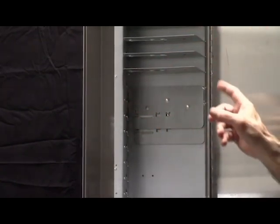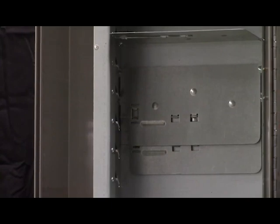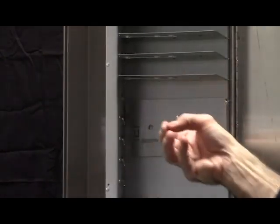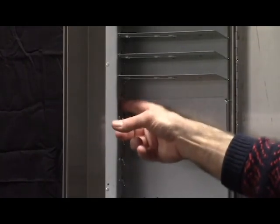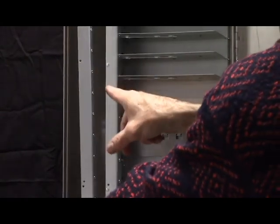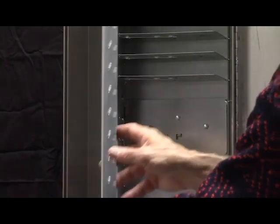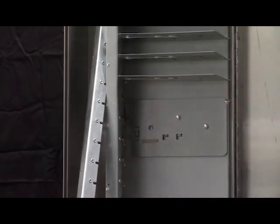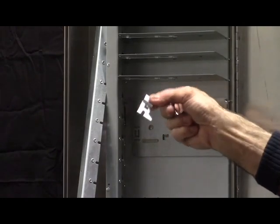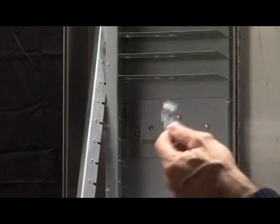Today I want to show you how to carefully lubricate this area. The shelf has a latching wire — that's what sets the shelf. The edge of this piece of metal, which I have a separate piece to show you — we call it the latch bar. Inside here, we call these pieces the triggers. These triggers operate by gravity, so we do not want to lubricate these pieces inside. You do not want to spray WD-40 or put big globs of grease or oil — they will end up causing a problem.